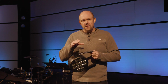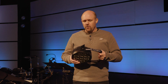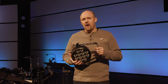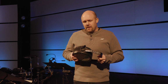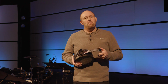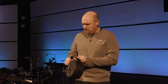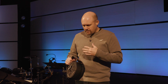And the rating on these lights will be the maximum that the light will draw. So in this case, this Chauvet wash light will draw 99 watts max. And so technically, I could put approximately 20 of these on one circuit. Now, that's not always the best thing to do, to run it at the max. So you usually want to go down to some fraction of the maximum, maybe 75%. In this case, they actually have said on here how many you're supposed to be able to put together. And so you kind of have an idea.